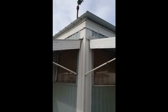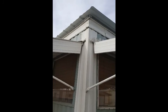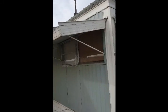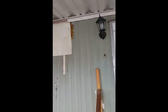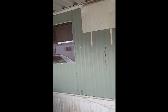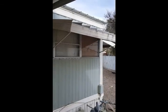All right y'all, we're back doing the roof again. Wanted to talk about this overhang here. When you're living in a trailer, you're going to need about a three-inch overhang to let the water come off the roof so it ain't running off the wall. Over here — I don't know if you can see it — but there's stuff running down the wall. That's water going under the awning, coming down the air conditioner, down the wall, and into his trailer.